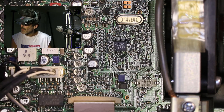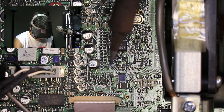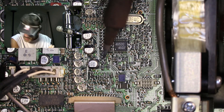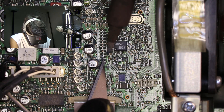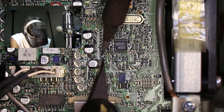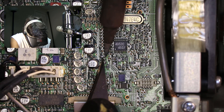You've also got this IC right here — be careful where you put the soldering iron because there are cables everywhere that you might wind up touching and burning. I'm going to try to come in at an angle where I'm not burning anything and not blocking the camera. I use an exacto knife and kind of get underneath there — just put light pressure on it, heat it up a little bit, light pressure on one side, heat up the other side, and just keep working back and forth.